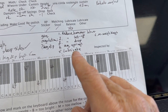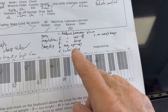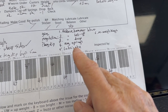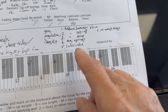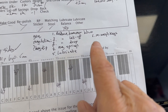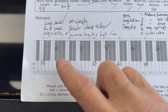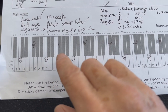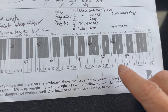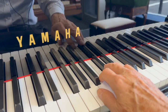I should also mention back check, which comes after springs — checking whether it's catching the hammer the right distance from the strings; five-eighths is normal. And lubricate, as mentioned. Re-weighting the keys is also needed: the key weight is quite varied — we've got 53 grams in the bass, 48, and then it suddenly goes down to 38 — so we definitely need to re-weight the keys to even them out, so you can play it just like a new piano.